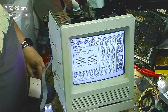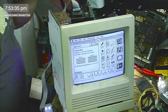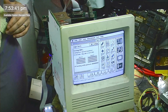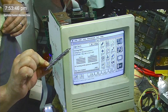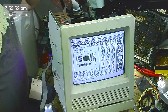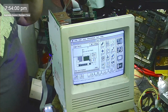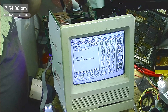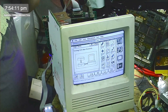Now we're still not home free yet. I can boot from a floppy but I cannot boot from SCSI. I can't boot it using any of the third-party ROMs such as the Big Mess of Wires Rominator or the Satanic Mac Club SMC ROM — these just give me sad mac errors. When I run a snooper test the RAM fails, the PRAM fails, the clock fails, SCSI fails. CPU, ADB, and FPU are fine, but we are definitely not home yet.